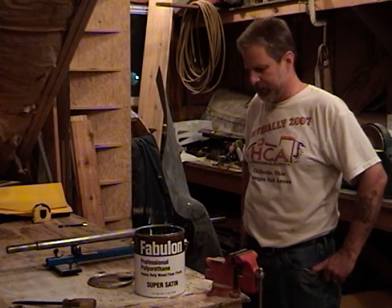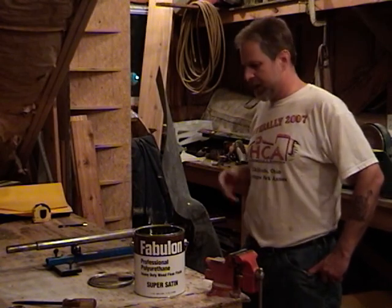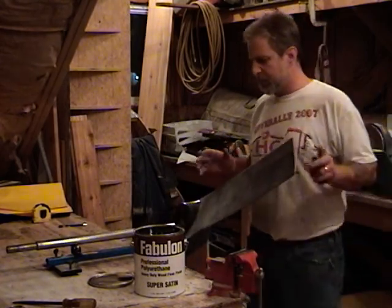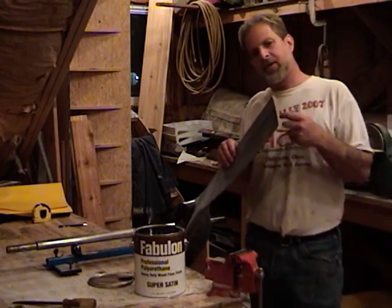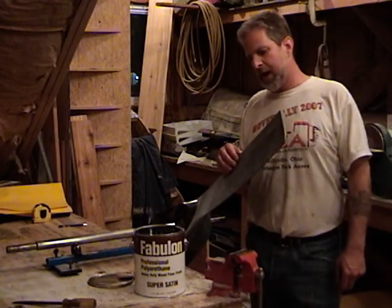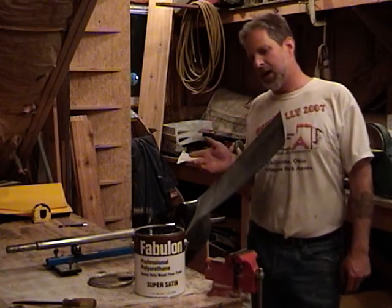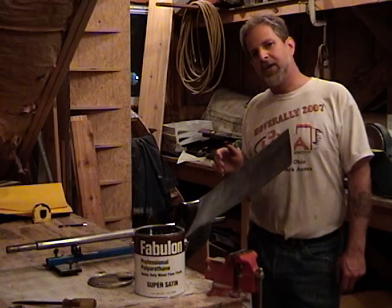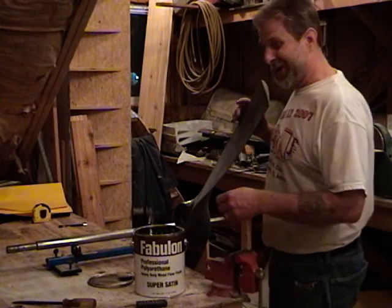It's the beginning of June. I've taken about a month off from prop building but I'm back to the final stages — just trying to fill you in on what I'm doing last. Tonight I've got the prop on the balancer. I'm going to do a static balance first, then I'm going to start putting a polyurethane sealer on the surface of the prop — about two or three coats to seal it all up, and then the final coats will be used for balancing.